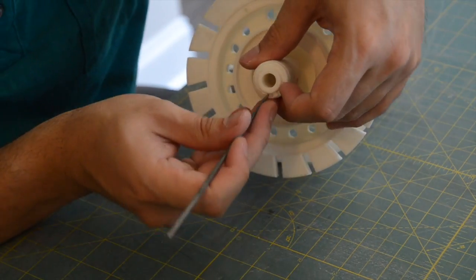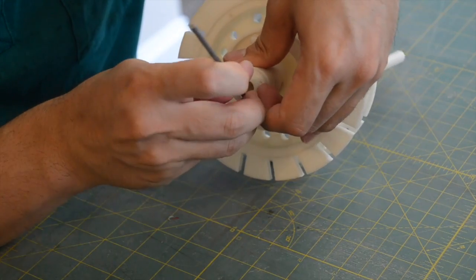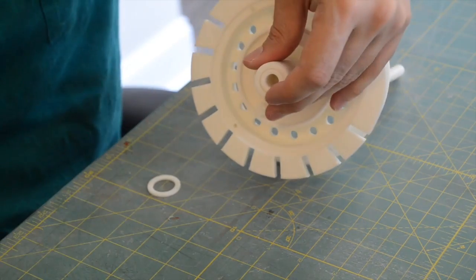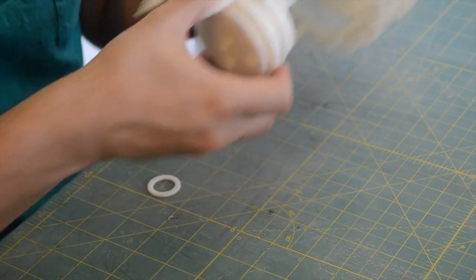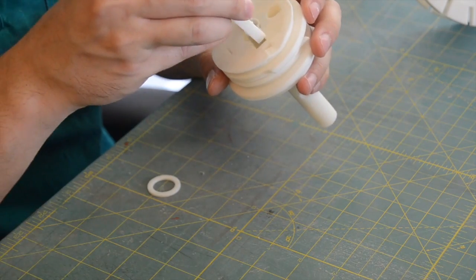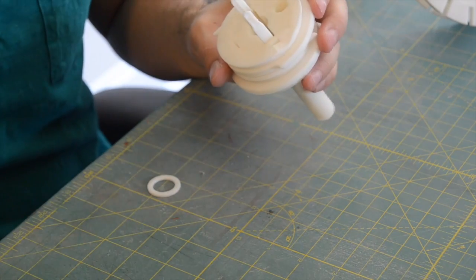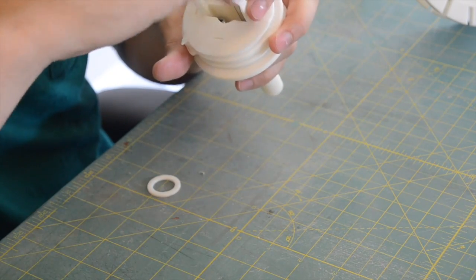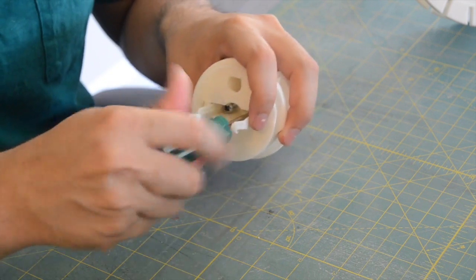Here, I forgot to add the tens bell spring onto the tens bell, so I am detaching the C-clip and removing the tens bell in order to add that spring back in. The tens bell spring is attached to the tens bell underneath by two M4 screws.